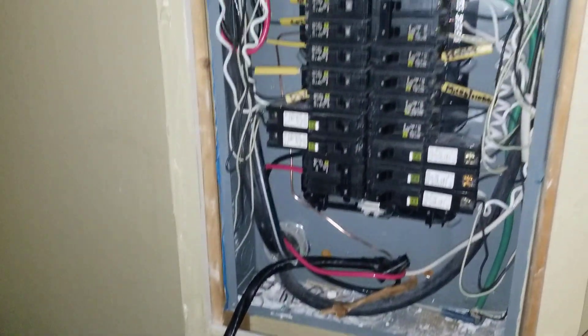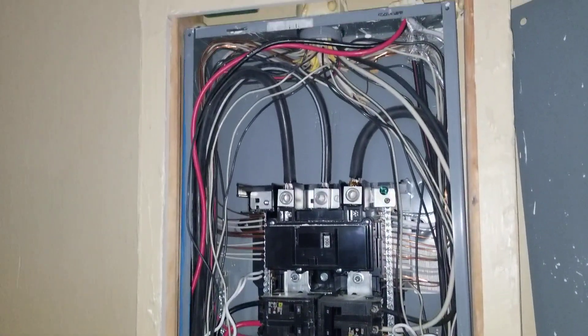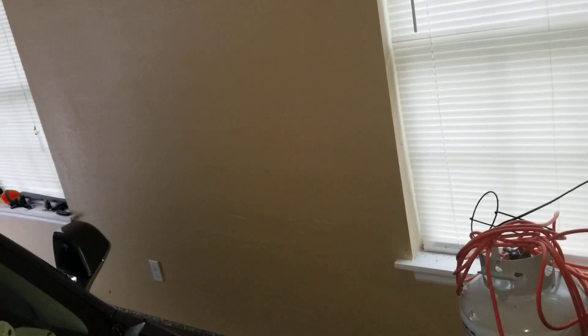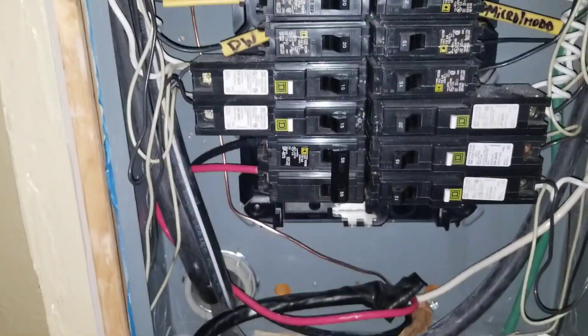What I'm doing right now is basically testing before I mount everything to the wall. Everything here is live. This line right here I'm going to run down this wall, a little bit over, all the way around, and to probably the top of that receptacle over there — that's where I'm going to mount my NEMA 14-50 connector.